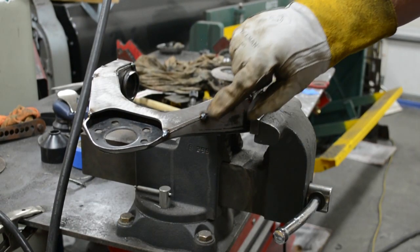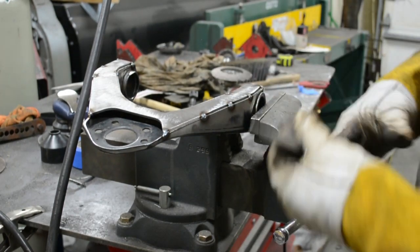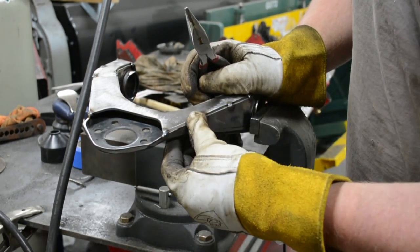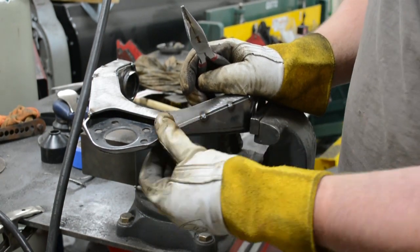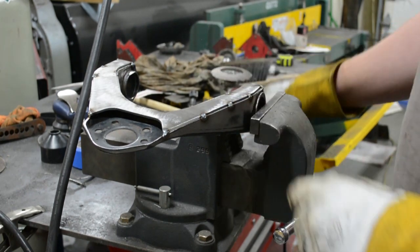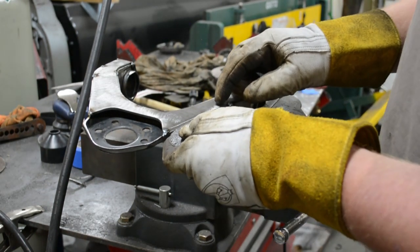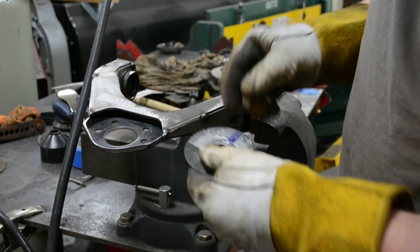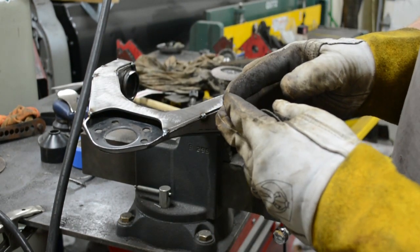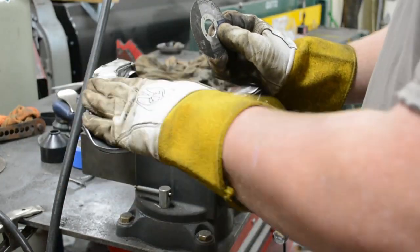These areas are nice right here — we've got edge to edge, which gives us a nice place to pull the weld, and then when we grind back, we're not grinding back all the weld. Now if you see here where the metal is flush — we can weld this and grind it back, but by the time we grind it back there's going to be no weld there anymore, and that's a potential crack point later. So what we're going to do is come back with a cutoff wheel on the grinder and literally cut in between this to create a little gap — the thickness of the cutoff wheel — come through between the tacks, break open a bit of a gap so there's something to bond together, the weld fills into a groove, and when we grind it back smooth we still have weld integrity in the arm.